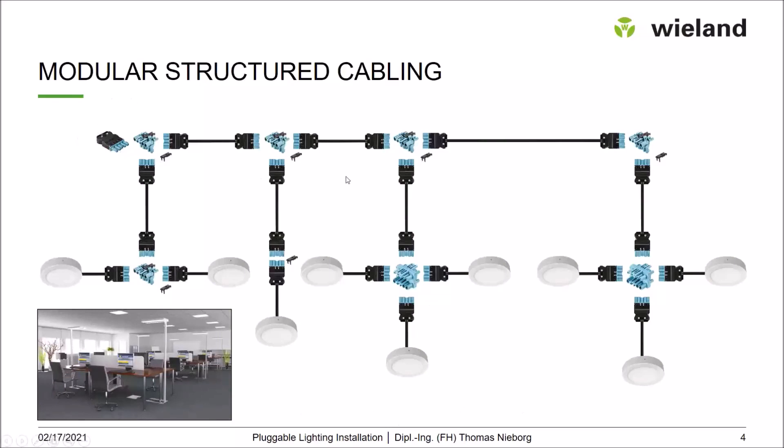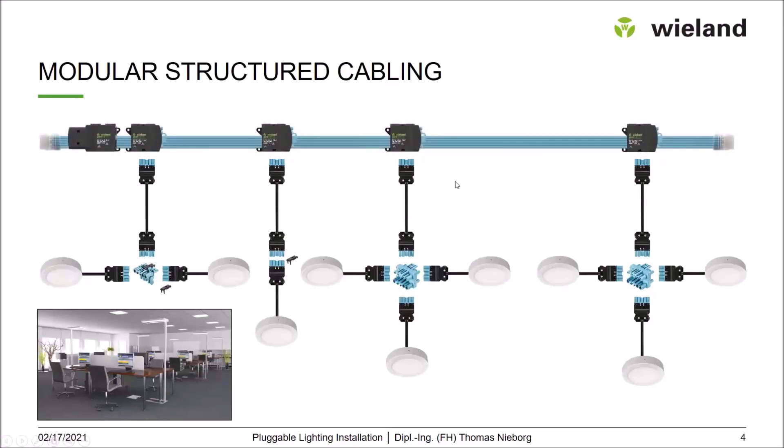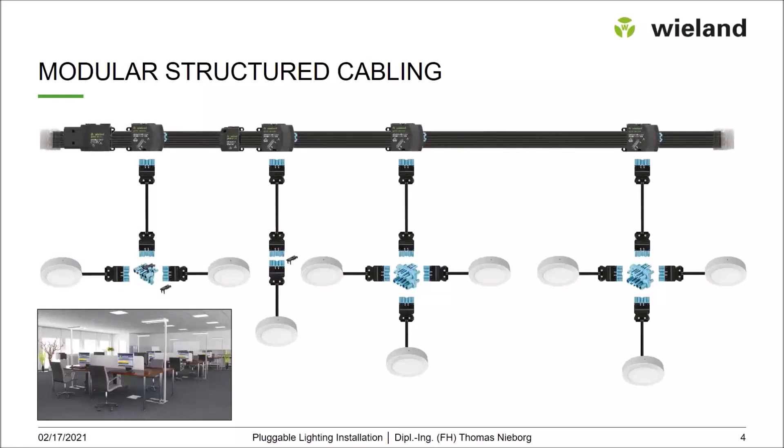Going back to the infrastructure for dimmed systems: the minimum is a five-pole infrastructure cabling with distribution blocks. For more flexibility, use a special flat cable with a special coating in a matching color. This provides a three-pole or five-pole output to connect luminaires with single-phase power and DALI signal, or single-phase power and 1-to-10 volt analog signal. For very high loads, a three-phase flat cable solution plus dimming signal is also available.